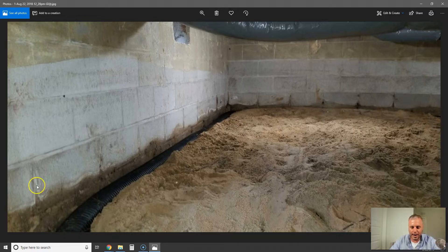Now, if you just put a sump pump somewhere, it will not collect all the water that is coming through the entire crawl space — it won't magically find its way to a sump pump. You must have drainage or drain tile installed next to the footer, right down beside it, not on top of it. It actually needs to be down by the footer.